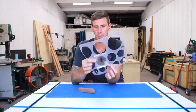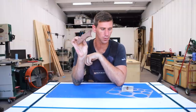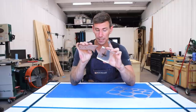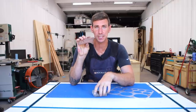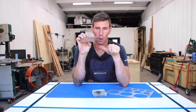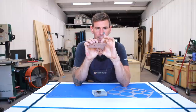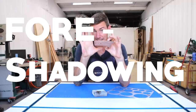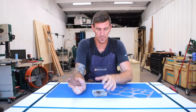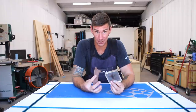I'll cut the epoxy into a circle, cut the matching profile into the base of the handle, and then epoxy that into the handle. And then in order to hold that in place, I'm going to do a steel wrap that's going to get mortised into the handle, go around the Murder Hornet. I'll use a piece of brass and rivet that into the wood. This is the last difficult step of doing this knife. This is a bunch of stuff that I've never done, so hopefully it will not be a total cluster fudge.